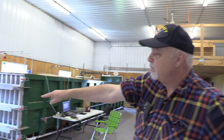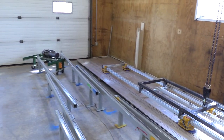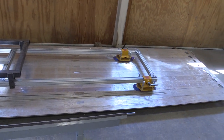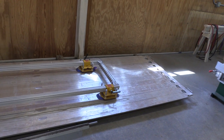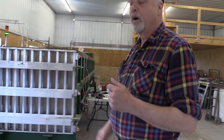What's in between all the wood — are these plates over here? They're 26 feet long and 50 inches wide. You have a plate on the very bottom, a layer of lumber, a plate, a layer of lumber — that's how we load the kiln. We attach hoses on the end once the load is in the kiln, and that pumps hot water through. These plates are circulating warm water that we control off the computer. As the wood dries in the chamber, the water comes out of the wood, flows off, and flows out the drains — no pressure. That's merely to maintain a temperature.